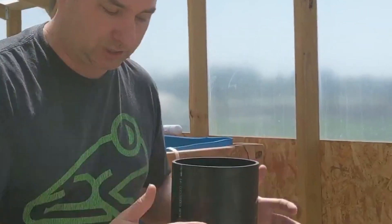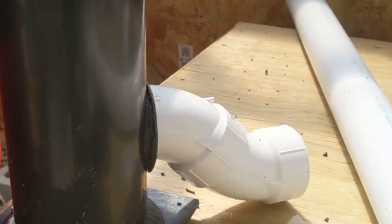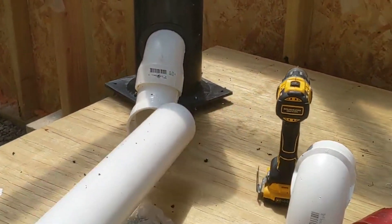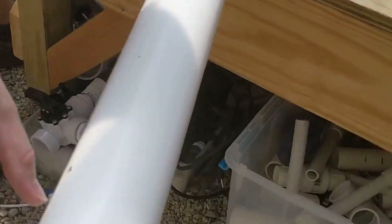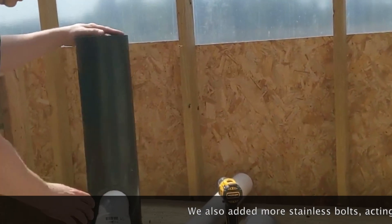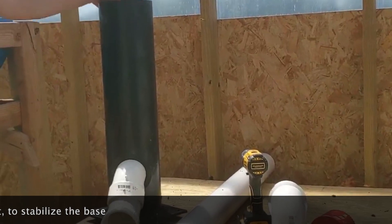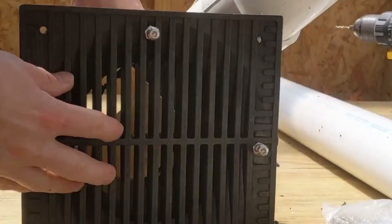We're going to do an L-shape — going from the center drain, which is this unit here, out and over to the sidewall of the tank, up the sidewall, and then out. So it'll be a 90-degree L-shape. That is the lift or the drain here, and this will draw the water in over here and then up the sidewall and out. This will make sure it can't rock around, and with the weight of the pipe holding it down it'll be a lot harder to move.